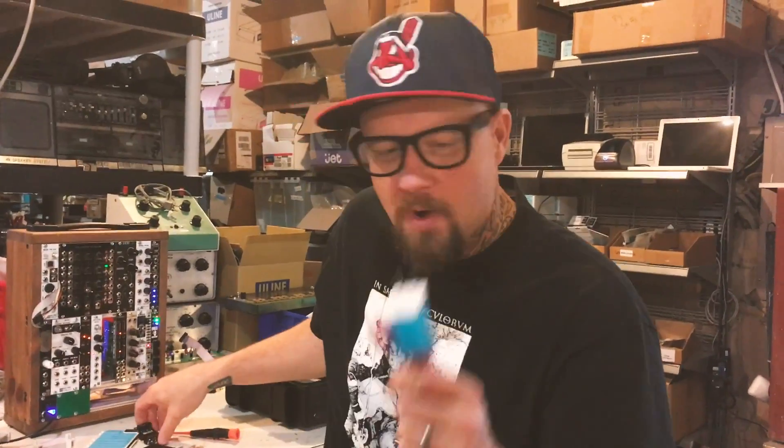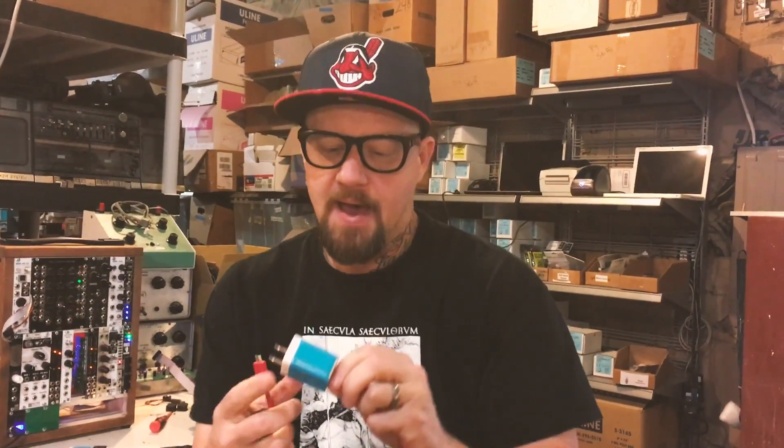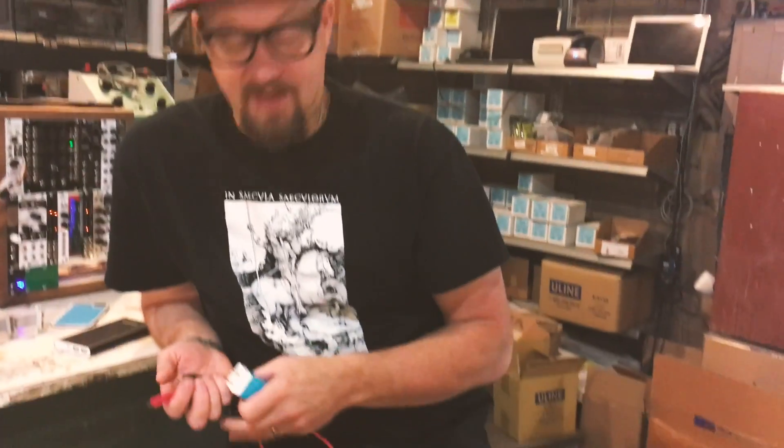It's a great option for powering your system. Yet another way is to use a wall wart charger adapter. I got this one from fast gear, off Amazon — it wasn't that much money. It tells me it can put out about 3 amps. So you can run the positive and negative 12 rails on the larger converter at 250 milliamps, and that should be able to power it just fine and even have some room left over for your 5 volt rail.